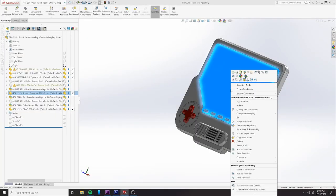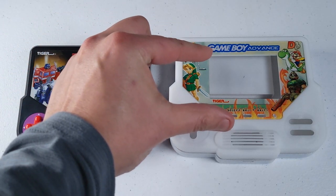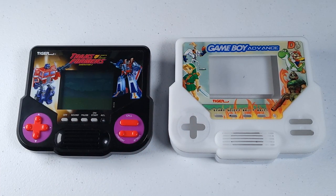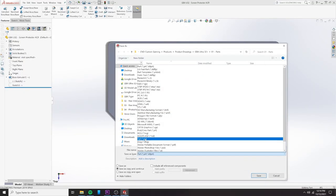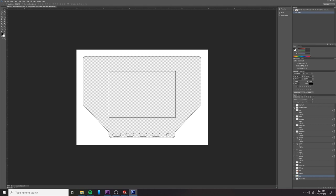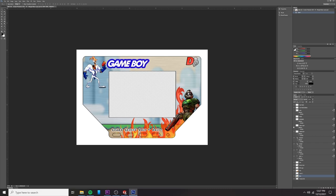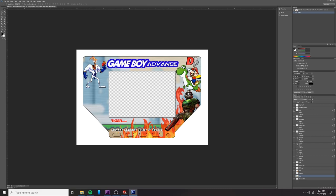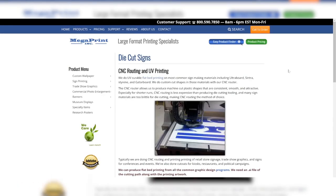The first thing I needed was an actual 3D model of the piece, done at the time of the enclosure design. Careful scaling had to be done because of the size of the IPS screen, which is actually a fair bit bigger than the Tiger display's original — and because of this, the whole handheld ended up having to be bigger than the original as well. The second step was exporting a DXF file for a toolpath and scaled outlines for Photoshop. Once I had my outline, I was ready for the graphic design — coming up with something that would complement both systems. The next step was to convert my design into the correct print and CNC layout.